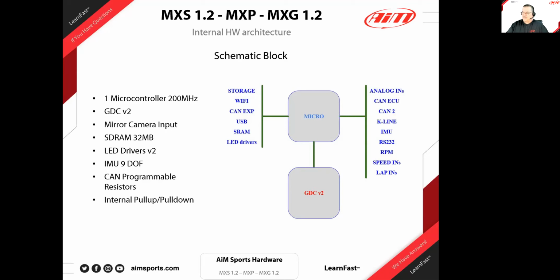Do dashes use a commercial real-time operating system? You talk a bit about the software development environment you work with for the dashes, as far as that part of it, right? Not on the software side, obviously. We have mainly two stages in the development. We have the hardware development that is made by a dedicated software. We use Altium Designer, and with this we can work very well also with the mechanical guys, because we work in 3D. So we can check the complexity of the board. We can check if the board fits inside the mechanical part.